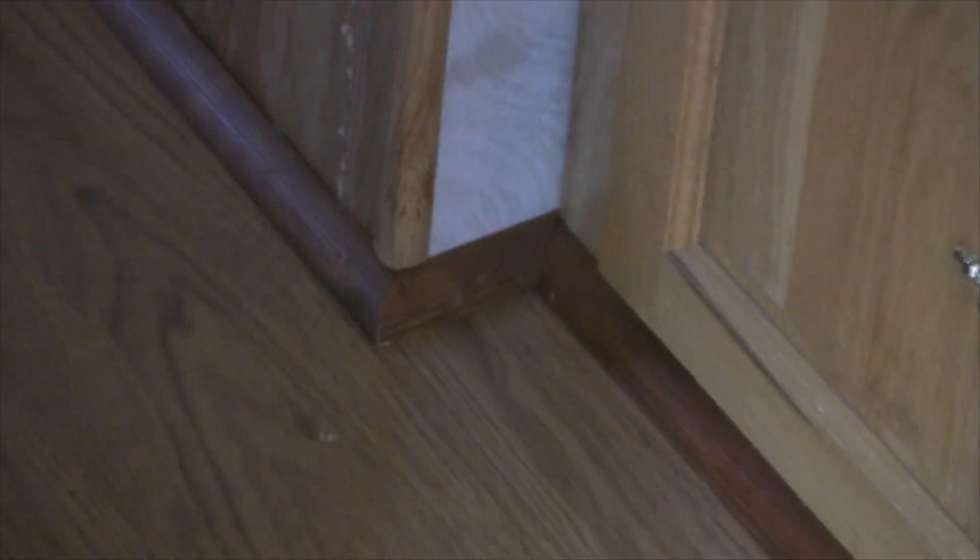It just makes it so much easier to clean. I've got these little transition boards here that go down and take you from the flooring over to the carpet. Then there's quarter round around the walls - that's kind of tedious with all the little pieces. There's an inside miter there, and here's an outside miter, and you keep going. There's a little bitty one - about a three-inch piece back there - and then there's some 45s and some 22-and-a-half degree angles that go on back into the bedroom area. Then I blocked it off again right here with another transition board.